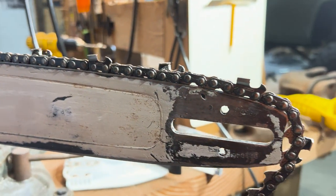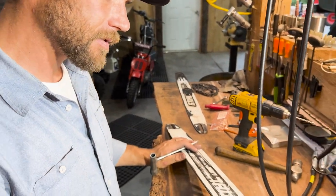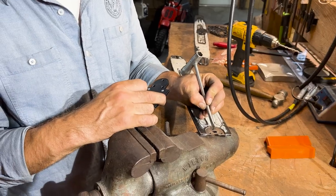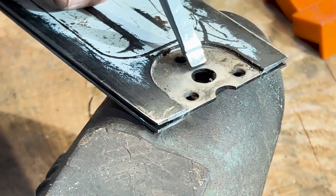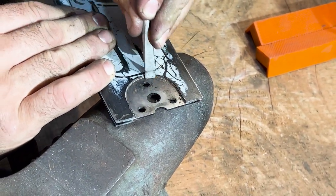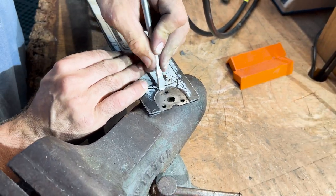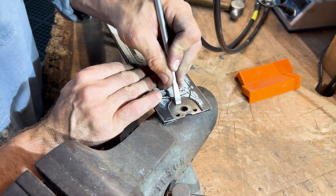Final check and we're good. Now we'll put the tip back on. We've got the bar tuned, rails squeezed, and a new tip ready to go. An old tip will have dirt, debris, and tree sap underneath it — you don't want to put a new tip over that because you'll have a gap. Always clean out your corners and crevices and get rid of old gunk and tree sap so the new tip has a nice flat spot to seat against.